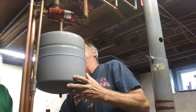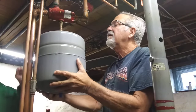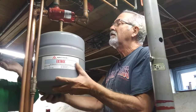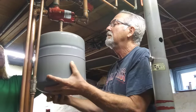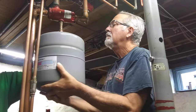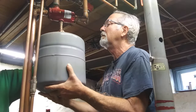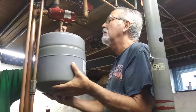It should be loose enough to get it off. I would suggest that you have somebody here to put their thumb over this pipe so that the entire system doesn't drain down. That's what I'm going to do right here — right there at the end of it. Put a bucket underneath it to catch the water.